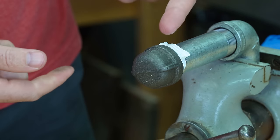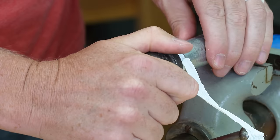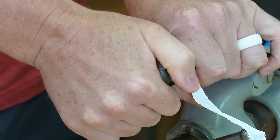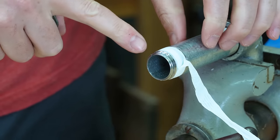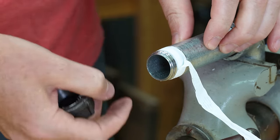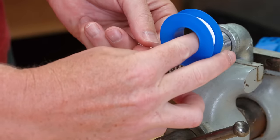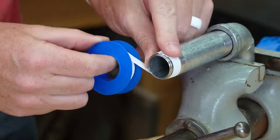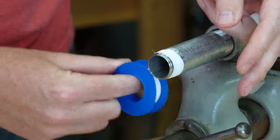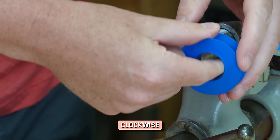It's just wrapping all the way around — a whole chunk is already loose. Then if we take it off and take a peek, there's actually no thread tape on the first couple of threads because it's pushed off as we went, basically making this void and pointless. That's why it's important that we always go in the same direction that the new fitting is going to be threaded, which is almost always clockwise as you're facing the opening.